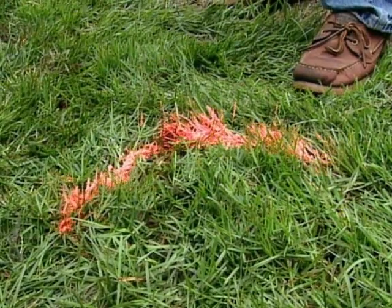Now, at each corner here, we've got to dig a post hole. And I understand it gets kind of cold here. A little bit. This is Minnesota, after all. Yep. We've got to go down 42 inches, 3.5 feet, in order to get below the frost line. Otherwise, the ground could freeze and start pushing the posts up, and that wouldn't be a good thing for an arbor. And you said we had to dig. We have to dig. I've got 2 of these, so you can trade holding off.